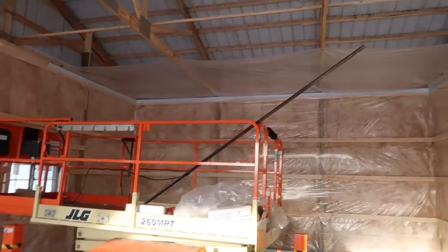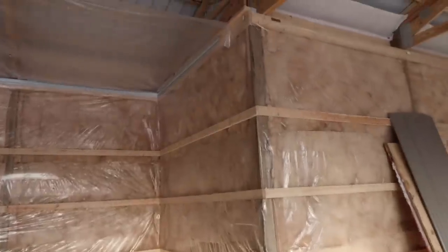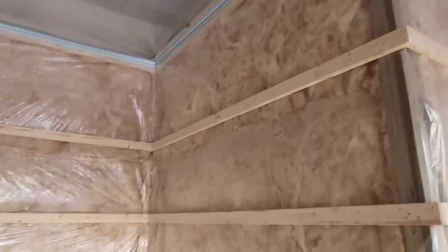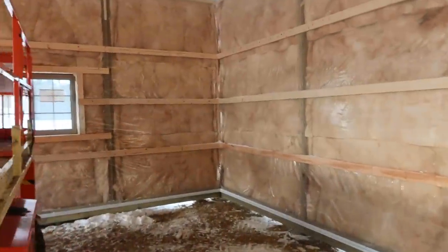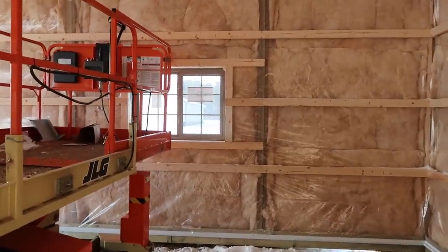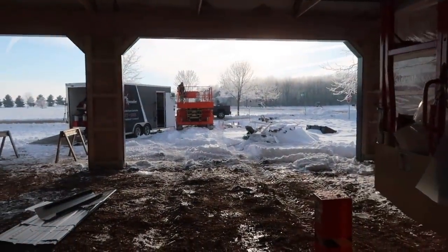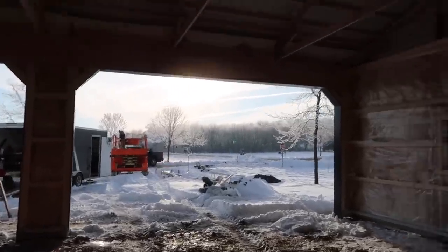So we're gonna go ahead, we'll get our vapor barrier up, we'll run our F&J, same stuff that we use out on the soffit, except it's a little bit bigger so that the steel can go in the top, and then the sidewall steel will go in the sides. Now this is the first job I think we've shown. We're gonna do all steel, so the whole wall will be steel, no plywood, which will bring a little bit different detail on the windows. I'll take you through that, show you how we do the window trim, door trim, but we gotta get all this steel organized for the ceiling so we can get it up in the lift and get going.